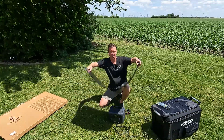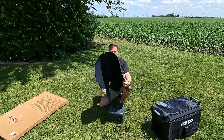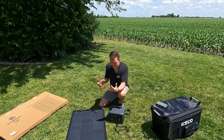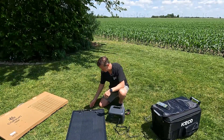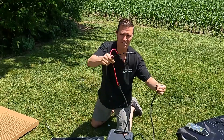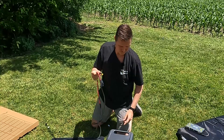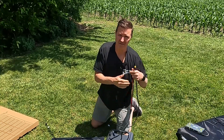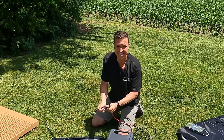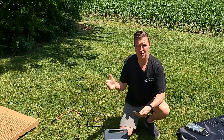This panel is flexible — you can flex it almost 180 degrees in either direction. It's not going to fold up like a paper towel or anything, but it is very flexible. I got the positive and negatives untwisted and I'm going to connect it to this MC4 to XT60 connector to hook it up to my AC50B. What I like about MC4 connections is there's no way of screwing it up — you connect male to female on each side.